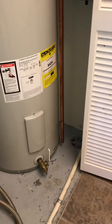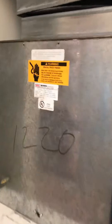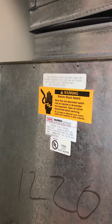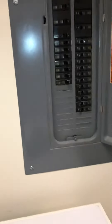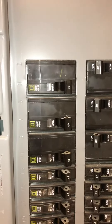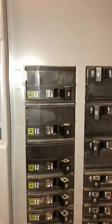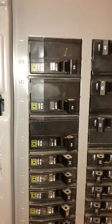The condensation drain is running — you can see the drain just to the side of that water heater. It actually looks like it's got an electric heater on it. There's an electric panel right next door, and it looks like there's a 60-amp circuit breaker on there for that heater, so it's possibly a 10-kilowatt, and then there's a 40-amp on the AC.